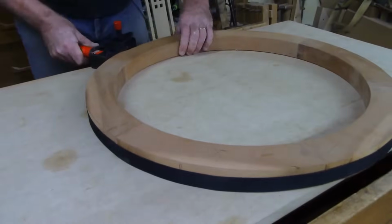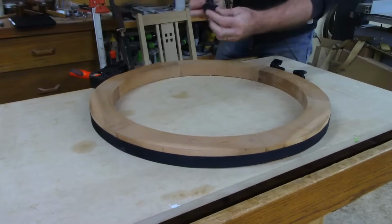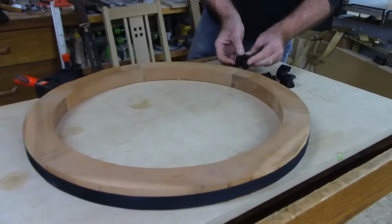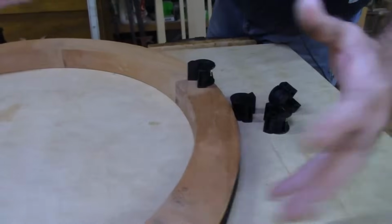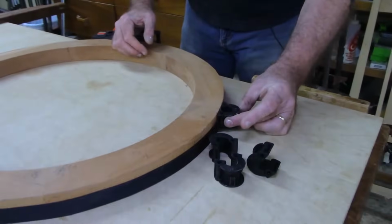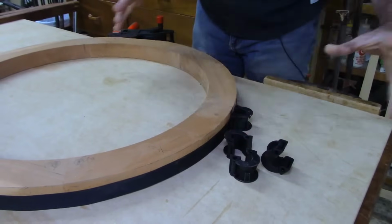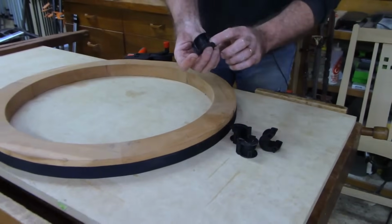So they make these little pads, like when you're working with corners, the strap goes through here and these little jaws go against, like usually it's on a corner. So what I'm going to work with is either a hexagon or an octagonal piece, so you'll have 8 pieces, 8 seams, and you'll need one of these on each corner. And the strap will go around, and those pads will distribute nice pressure right on the joint, forcing all of the joints inward, and the strap will slide smoothly on the outside.